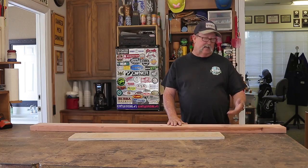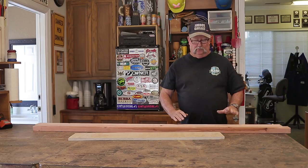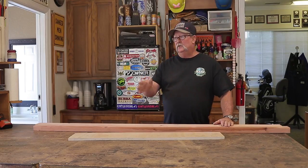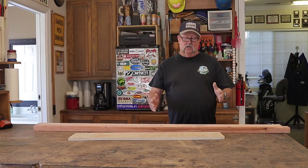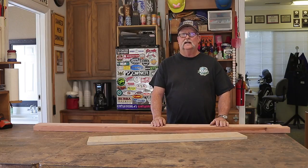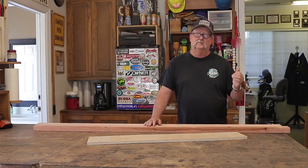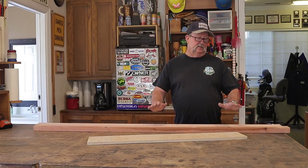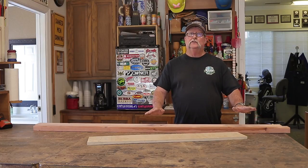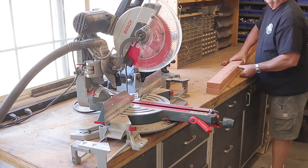What you'll need is a couple of two by fours. I just happened to have some redwood two by fours — maybe not the ideal choice, but I want to use them before they warp. You'll also need two pieces of one by six about 16 inches long. I went through my scrap bin and couldn't find one by six, but I found a piece of plywood I can cut down to two pieces 16 inches long and six inches wide. I'm mixing and matching lumber here, and that's fine since it's going in my office. You could use regular two by four or whatever suits your needs — I'm just giving you the idea to build a compact rack that holds a lot of hats.